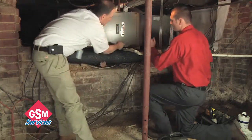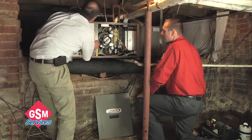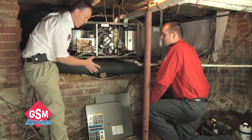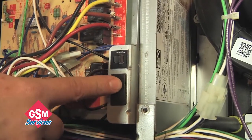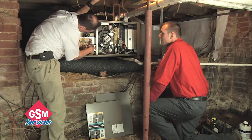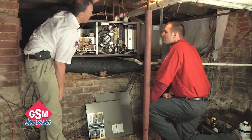We're going to come in first and take that door off and set it in a good secured location. Then we'll take the other door off. We're going to leave the power on at this point because we want to check the door switch — that's a safety to be sure the furnace loses power if the door is removed, which is a safety for our homeowner. I'll push this in and we can see these lights come on like they're supposed to. That tells me the door switch is working properly, so it is safe to go ahead and move into the furnace.